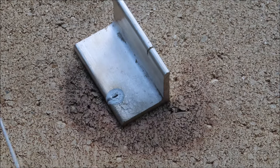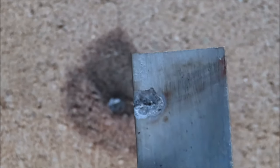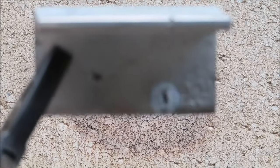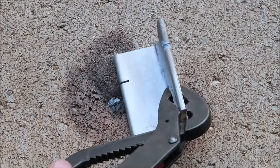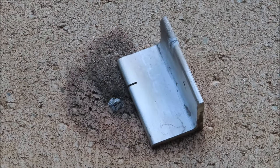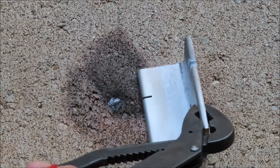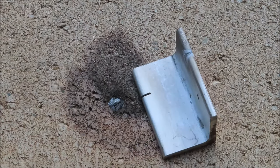Let's go ahead and try it again on the other side. It did seal it all the way through but when I sprayed the water on it, it created a bit of a hole. So I'm not going to do the water this next time around. Now, they say you're not supposed to heat the rod directly — you're supposed to heat only the parent material. So I'm going to try a combination of both and see how it goes.